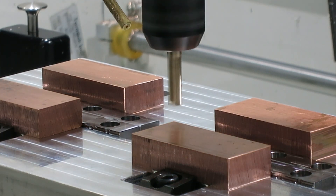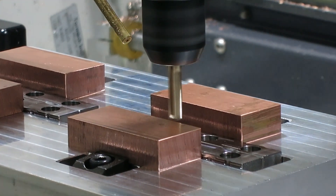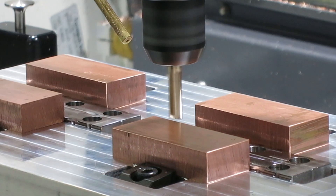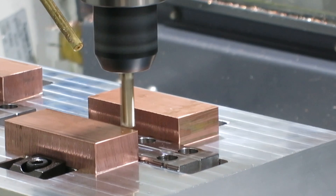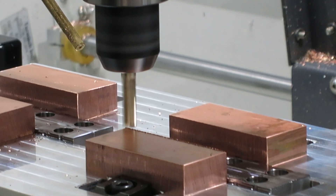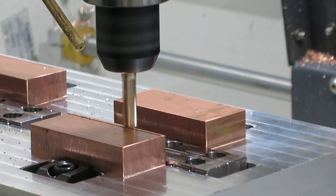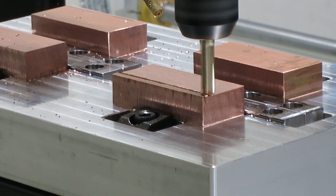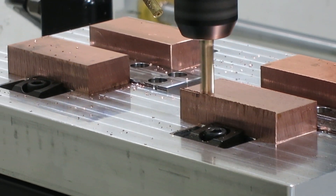This first tool is a quarter inch diameter square end mill, and what I'm doing with this pass is just lightly facing the piece. You can see it facing the top of that piece right there. The step overs are really short and close together because this tool path is meant for a machine finish with the lines really close together, although these are going to be bead blasted.